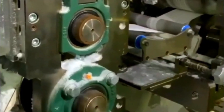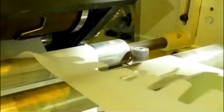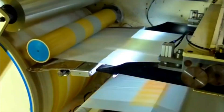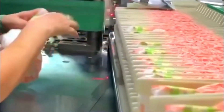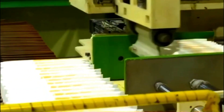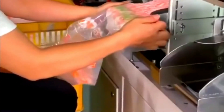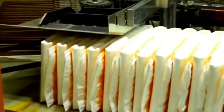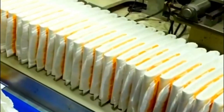Preparing the non-woven: using the melt-blown technique, plastic resin is produced into sheets of non-woven fabric. These sheets are made from a broad web roll then sliced to the proper width for use in diapers, with separate webs for the top sheet and the bottom sheet. Note that since non-woven fabrics are frequently manufactured in different locations, this phase does not always occur after pad construction. Large bolts of fabric are connected to special roller equipment that feeds fabric to the assembly line. Stretched elastic bands are then glued to the backing sheet to tighten and gather the diaper, guaranteeing a tight fit and preventing leaks.